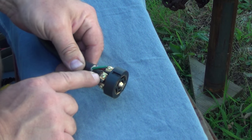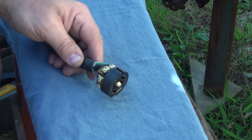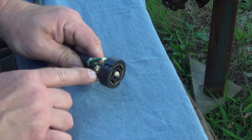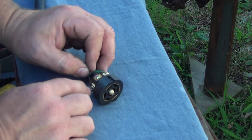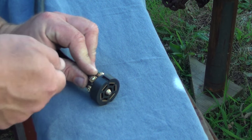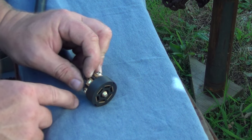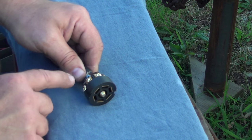These large wires — the black one and the white one — are a handful to work with on these type of connectors. In my case those wires are larger than all the rest and the connector doesn't really accommodate the larger wire with a bigger screw or bigger opening. Every one of these wires I've got looped around the screw and back through, within the confines of this square washer that has sides to it. Whenever you're tightening them down you'll need pliers, a wrench, or vice grips the same size as the square so that as you're tightening the screw with the screwdriver it doesn't allow the washer to spin. I've got them really tight — almost to the point where it's almost wanting to strip out.